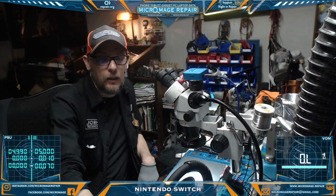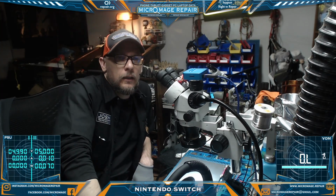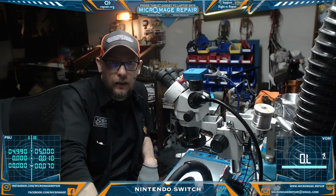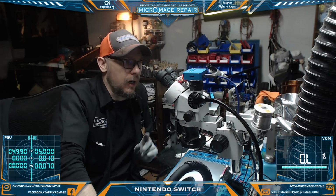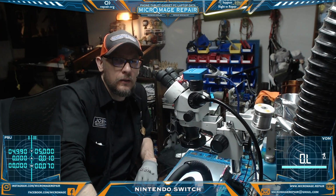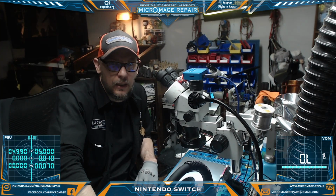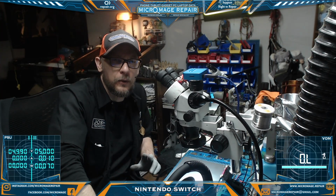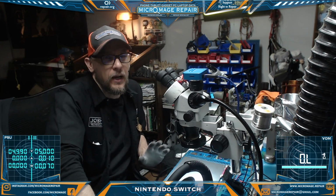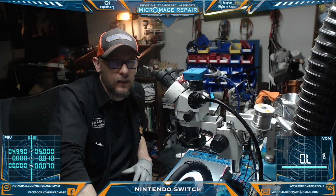Okay, in summary, we had a Nintendo Switch that appeared to be charging when we cleaned out the port. There's some fuzz in the port. But it intermittently stopped, and while we had it on the OEM charger just to charge it up enough to boot, it went to 5.17 volts at 0 amps, and then when we put it back on the PSU, we're drawing 0 amps. So that's usually indicative of something going on with the M92T36. That could be your fuse, that could be the M92T36. That's generally, or like the far right filter on the Pi 3 USB can cause that. Generally speaking, if the Pi is bad, you're getting some sort of current draw, or if you're getting issues with the 3-phase buck regulators or the gas gauge and stuff like that, you're getting some sort of current draw.